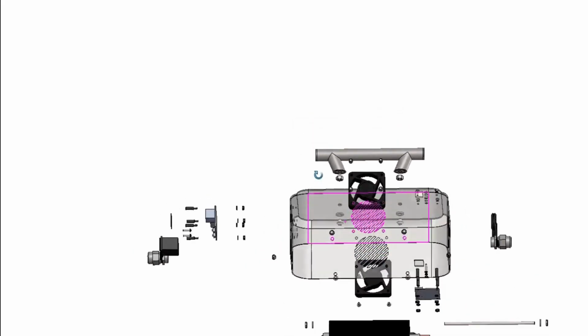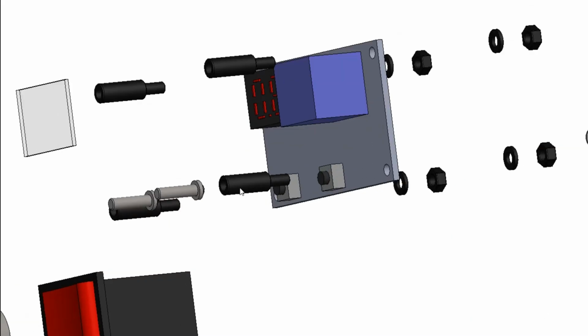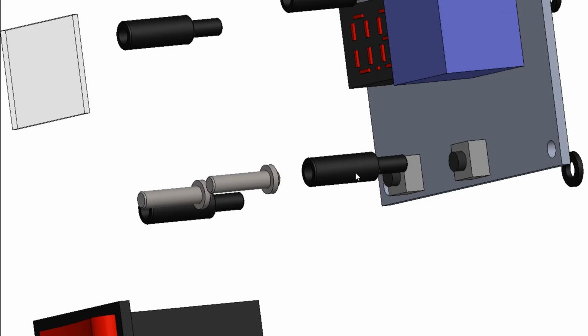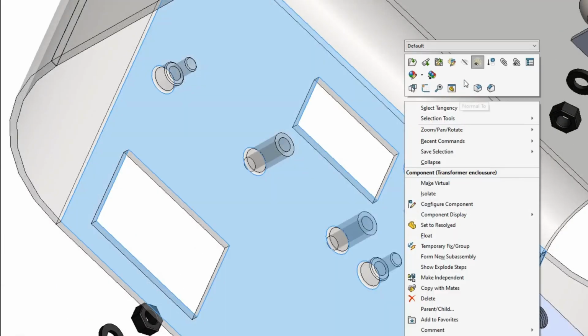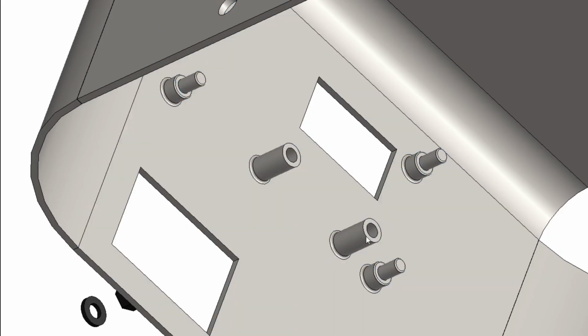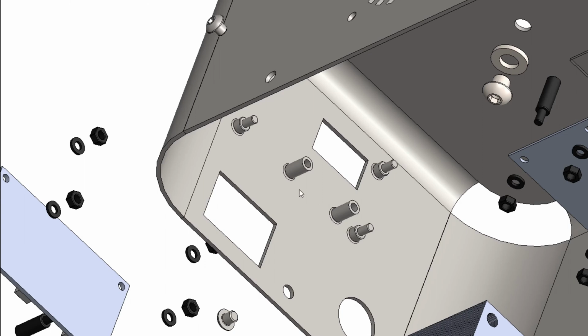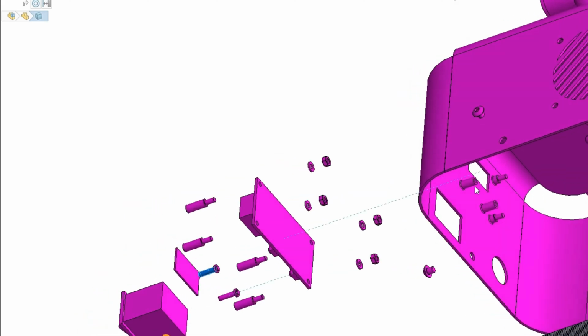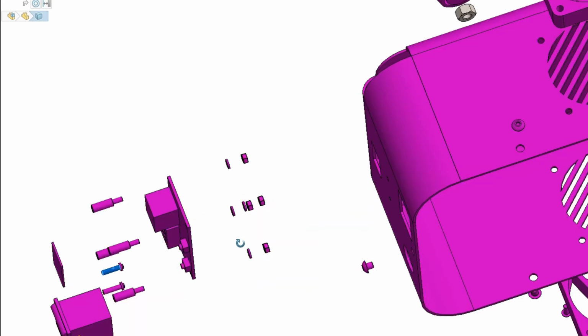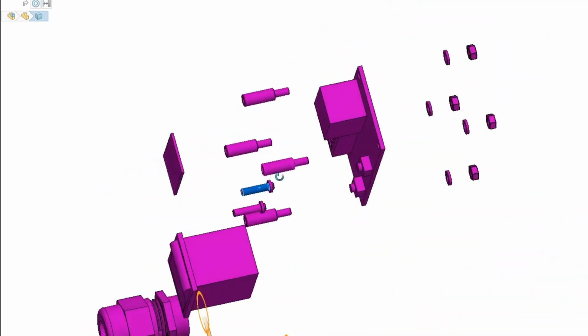What else is on here? Right, okay, so here these circuit boards are held using these wee nylon boss extrudes. And there's guides. These guides are TIG welded first onto the box itself, and the 3mm shafts with washers tacked on them are used to control the buttons here. They can't get out because they're on the side, behind, in front of the PCB board. So the PCB board is isolated away from the metal itself using these nylon bosses, like nylon shafts.